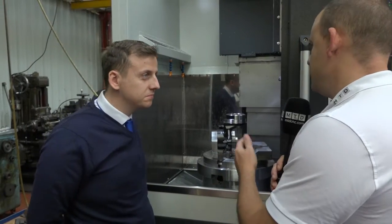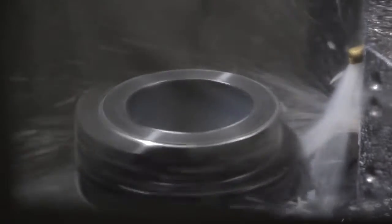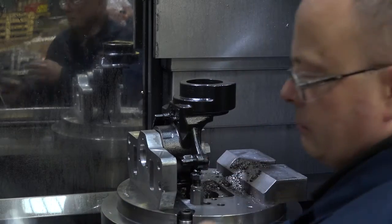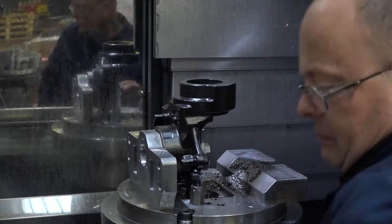When it comes to making one of these parts, have you seen a significant improvement in production since you've had this machine? Yes — it's easier for the operators, which reduces a couple of minutes in cycle time. The shorter rapids here and there really have a dramatic effect — you can get another two or three components done per day.